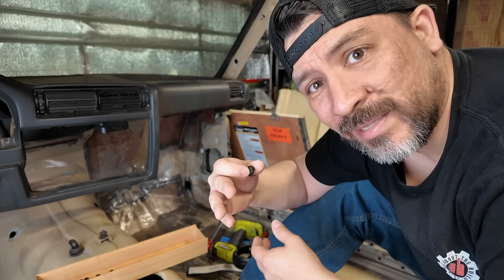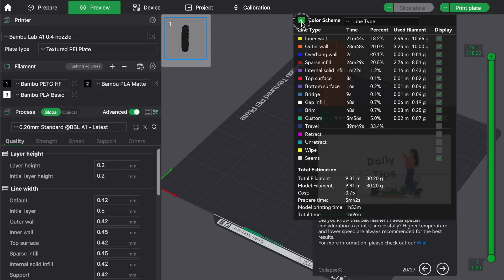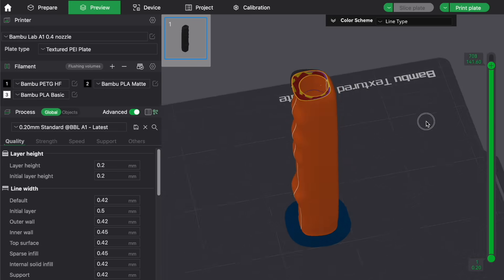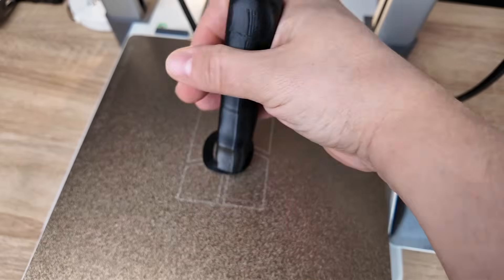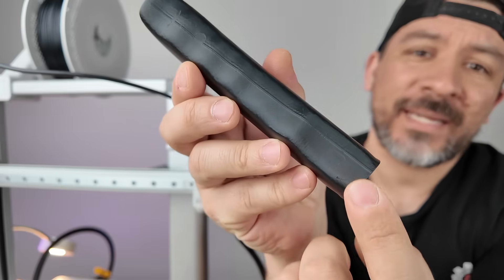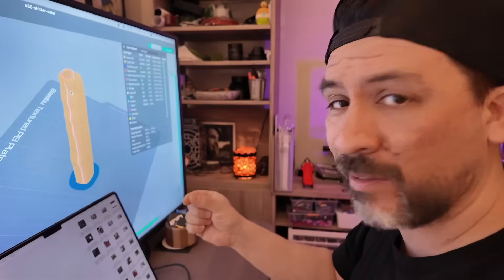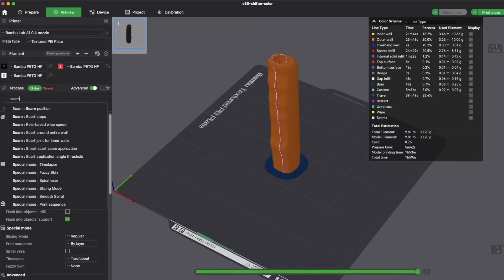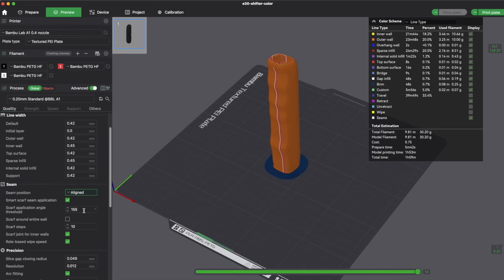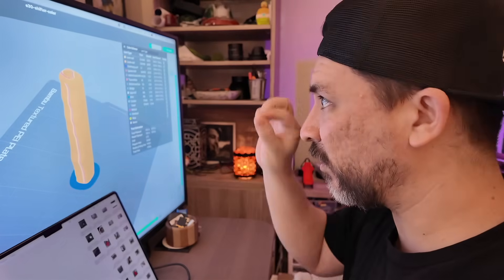These smaller parts work pretty well, but now we're going to test out some larger parts. This part is much taller — almost five inches — it's an e-brake handle that we previously 3D scanned and made into a 3D file. The part came out pretty cool; it's got the grip and everything looks good except for one part. Take a look at this seam. You'll get seam lines like that — it's pretty common. There is something you can do in the software to make that line go away.